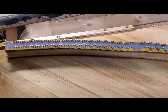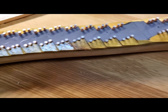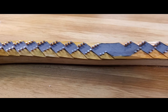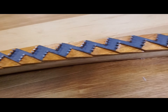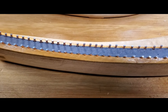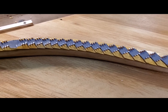Here's the Osage Orange and here's the way I use it — for bridge caps. The American Osage I use in the top two sections has a yellow color. Then since I have some Argentina Osage, I use it in the lower sections. The difference in Janka hardness: the Argentina Osage is 2300 Janka hardness, and the American Osage is harder at 2600 to 2800.